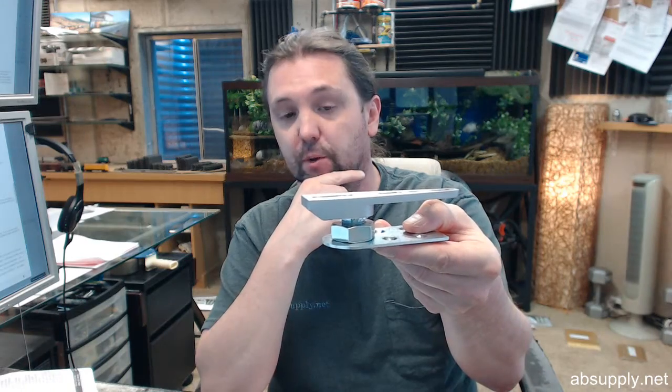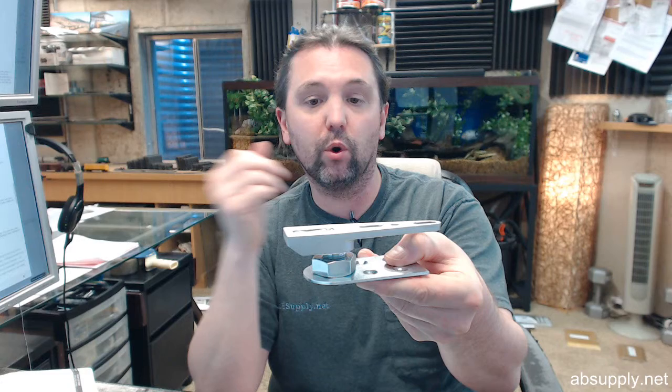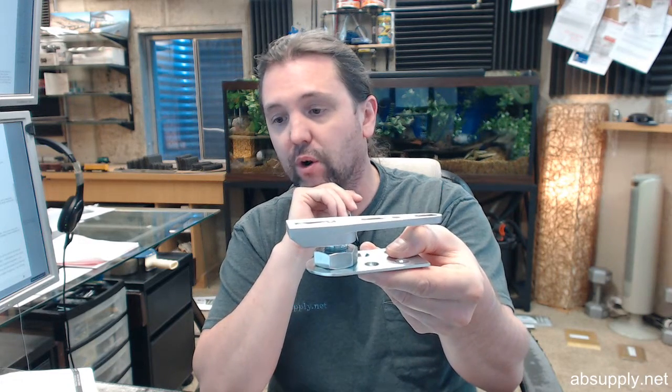Adjustable without removing from the door, that's obvious. You get in there with that wrench and you turn it up or down. It can be used with bottom door rails with a maximum of 1 inch depth. That inverted bottom rail cannot exceed 1 inch for all that math to add up and work out properly. Maximum door weight is 200 pounds. That means it's going to work with pretty much anything you're going to throw at it, aluminum door and glass related. Allows door clearance to be adjusted from 1/4 to 1/2 inch once the door is installed.